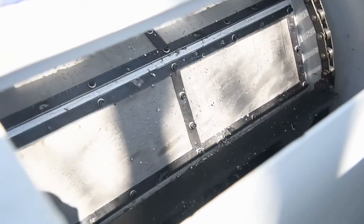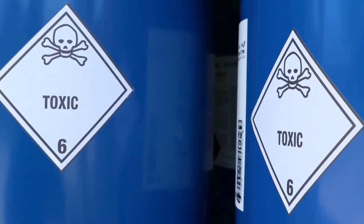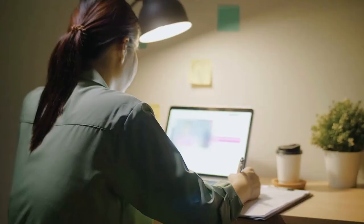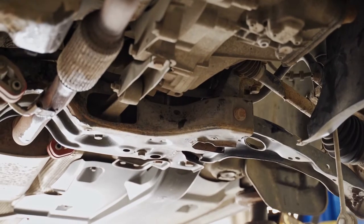The second important aspect in component washing is having an effective filtration system for your degrease chemical. Alkaline degrease solution is used in these component washing machines, normally at an elevated temperature of around 60 to 70 degrees centigrade. At elevated temperatures, dirt that sticks to a metallic component gets washed away effectively when the cleaning chemical is at a higher temperature. Your filtration system needs to take care of this fact.